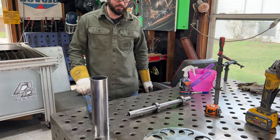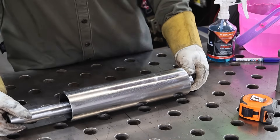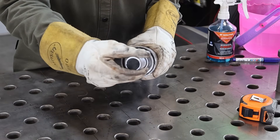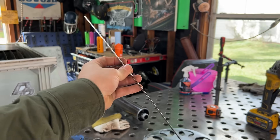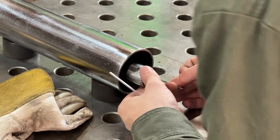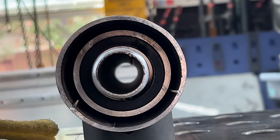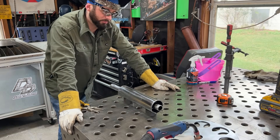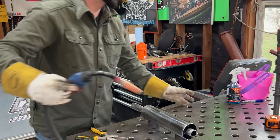Now all we've got to do is take our other piece of tubing and slide it in. It's got a lot of play, so we need to center it. To keep all that slop out, I've taken some 3/32 aluminum TIG wire cut to about three inches a piece and stuck two pieces on either end — that basically centers up everything. Now I can go ahead and tack four sides: top, bottom, left, and right. However, I think I should have scooched the bearings a little further out; it's going to be pretty hard to reach, but we'll try anyway.